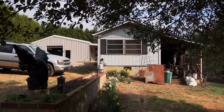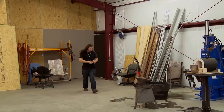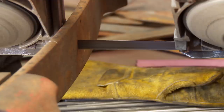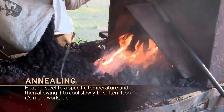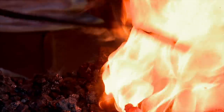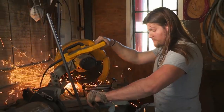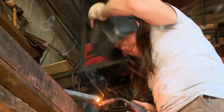We're back at my home forge. Let's make some blades. It looks like we're getting some thunderstorms, so I think Thor is favoring me today. The Akrafena was often made from iron, so it's very easy to work. I don't have to worry about annealing it. I'm a lot more comfortable in a coal forge — it's what I'm used to working with. In order to create a blade that will have a very strong edge but still be mostly iron, I'll fold the iron onto high-carbon steel and create a layered billet.